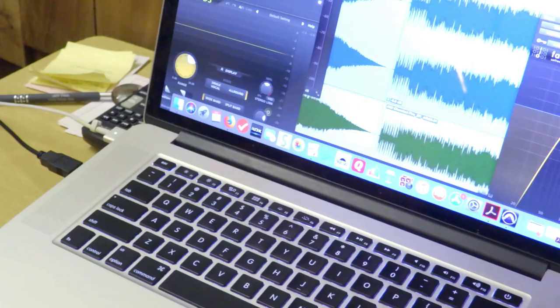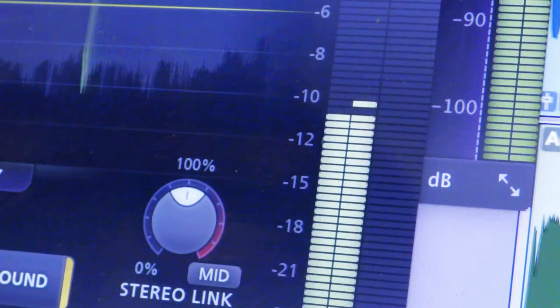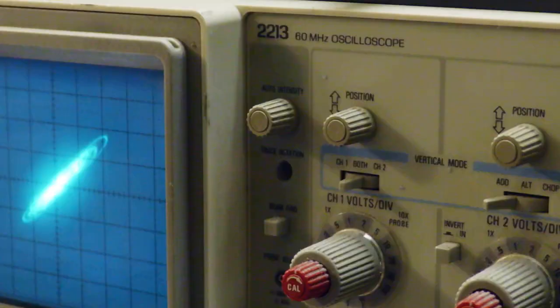I play the music to see the groove, make sure I'm cutting deep enough, and then I also check what we call the land in between the grooves. If you cut it too deep, they start coming into each other, and you can have what's called an overcut — and that's what causes skips. So I think we're good to go for real.